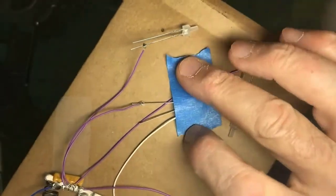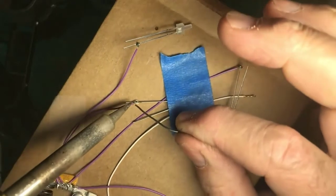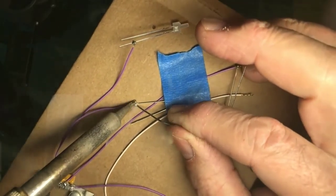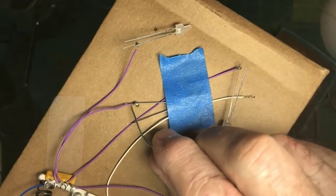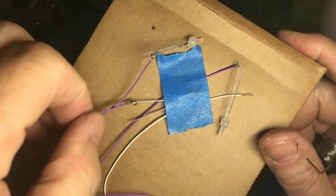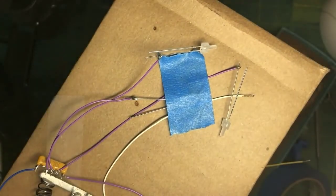All right, everything's held still. Getting closer here. Wipe the tip clean, fresh solder, apply it to the work, and solder. And again, I'm noticing as I look at this, it's bright and shiny. That's what we want to see there. It doesn't show up, I'm afraid, real well for you guys. I'm exceeding the limits of what I have in terms of a camera.